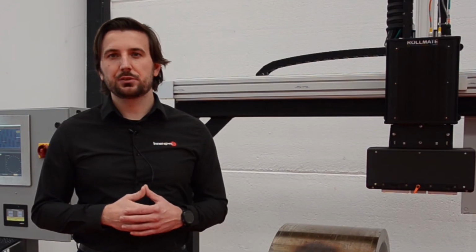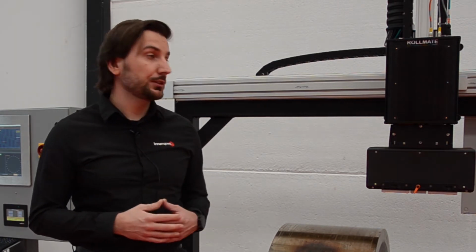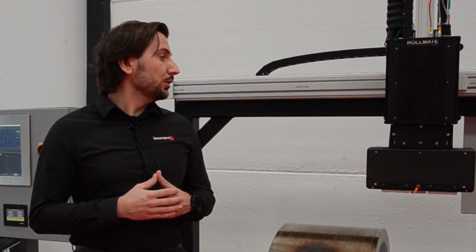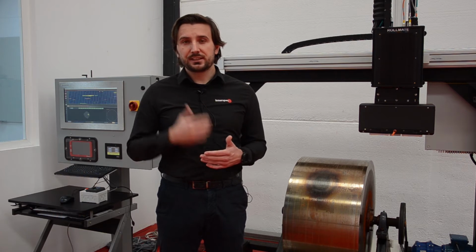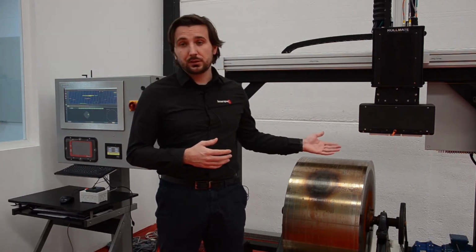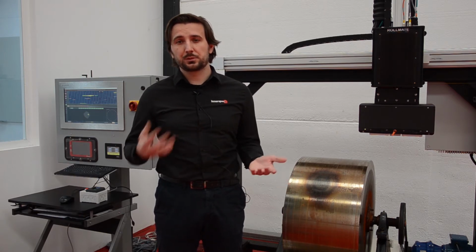Innerspec has more than 20 years of experience in developing roll inspection systems. And today I'm going to present the third generation system that we developed recently, which incorporates all the state-of-the-art technology by Innerspec. ROLLMATE can inspect any material, for example indefinitely chilled cast iron, high-speed steel. We can inspect any material, forged or cast, and also any dimension. Doesn't matter if it's the smallest sensor roll or the biggest backup roll.